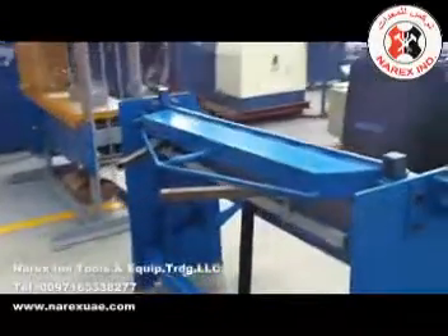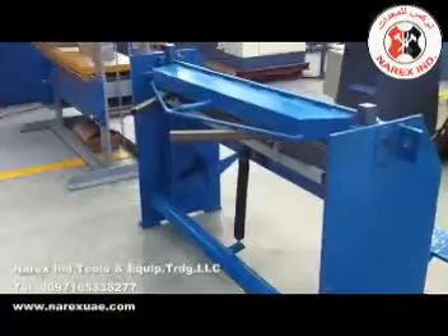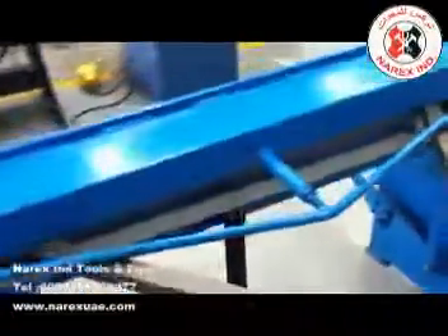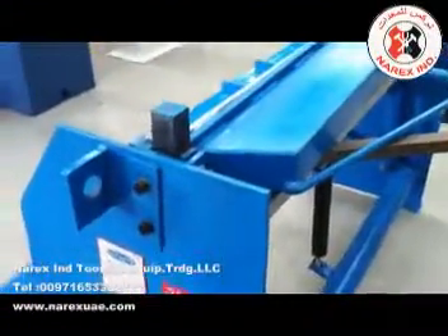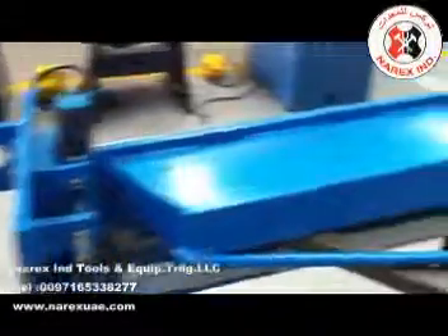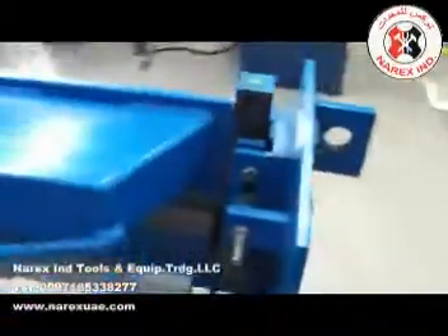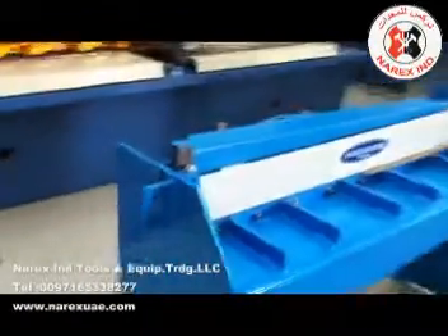Our machines are fitted standard with a manual back gauge and the cutting head is fitted with a torsion bar, so over time you can make any adjustments to set your blades. Also on the rear we've got adjustable gibs, so over time any wear and slack can be taken up simply by unlocking the locking bolts and nuts and adjusting your gibs to keep it nice and sharp.